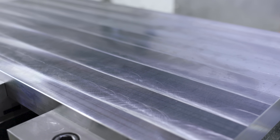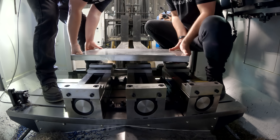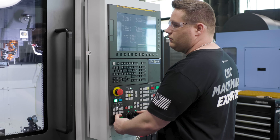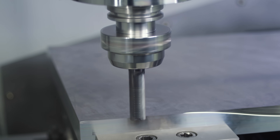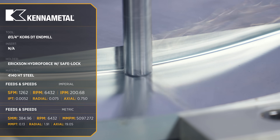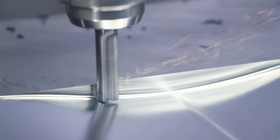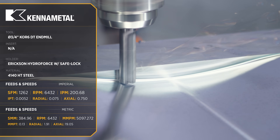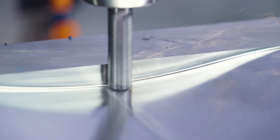The second side is complete — we've got the top side decked off and faced to length. Now we're going to flip the part over and rough out the wave on the other side. We're roughing out this wave with a three-quarter inch Core 6, running at 1262 surface footage in heat treated 4140 — that's insane. We're also feeding at 200 inches per minute. We're only going about one times D on the axial depth, which is three-quarter inch deep, but the machine is handling it fine. We're nowhere near the red on the load meter. Everything's looking really good — I'm really impressed with this machine.